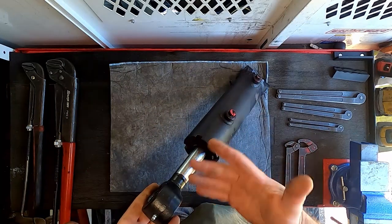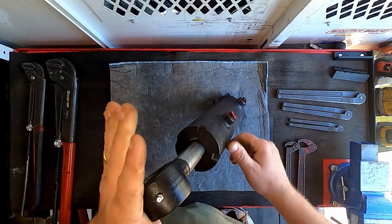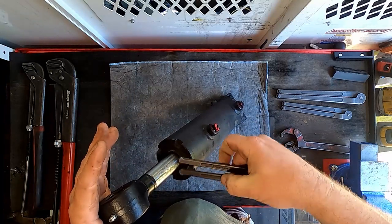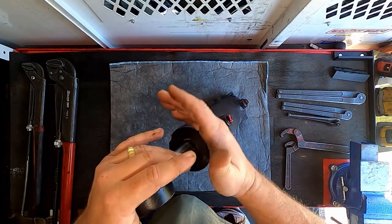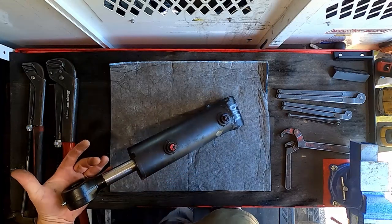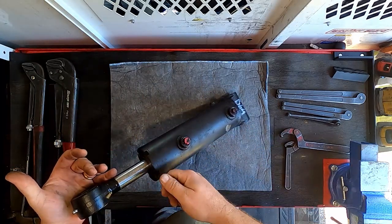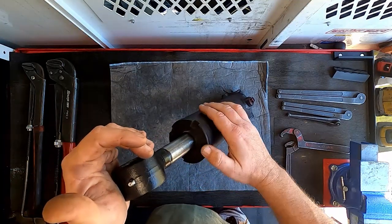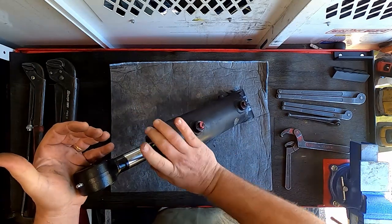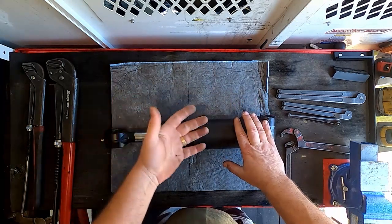The place where hydraulic cylinders vary the most as far as disassembly goes is the gland end — this little cap that holds everything in there. This particular one is meant for the little hook wrench. Some of them use little pin spanners. Some of them will actually have a set screw — make sure you get that out before you start twisting. Some of them have little wires that go through the cylinder that you have to feed out as you're loosening it. John Deere's got some real goofy stuff with their cylinders — snap rings, you've got to ram the gland. But this style where you just screw it off is the most common style you'll run into if you're trying to rebuild one of these cylinders.